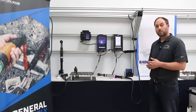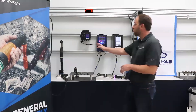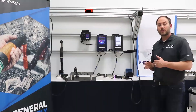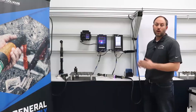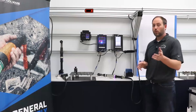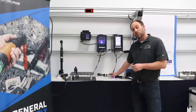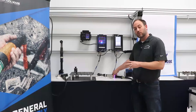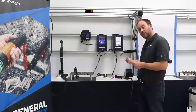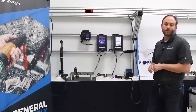Do you need a controller for each separate tool? For the cordless, yes — the Estet cordless system currently runs on a one-to-one basis. They are developing a more advanced wireless system for multiple tools to one controller, but as of today it is one-to-one. For corded tools in automated applications with two or more spindles, you can daisy chain the controllers together — one acts as the lead controller, communicates with the PLC, and controls and synchronizes all of them. But each tool still has its own box.